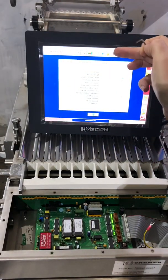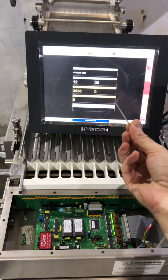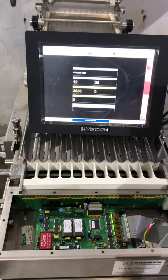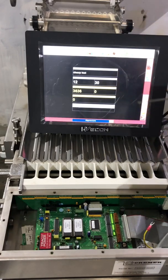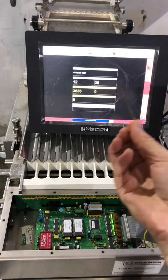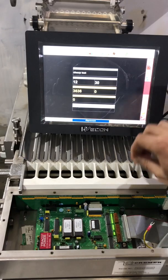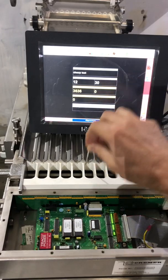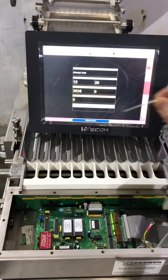I have a 2-millimeter allen key here. Since we set the product width to 15 millimeters, you would expect it will not detect this allen key. Let's check — none of the channels detect the allen key. That's all good.